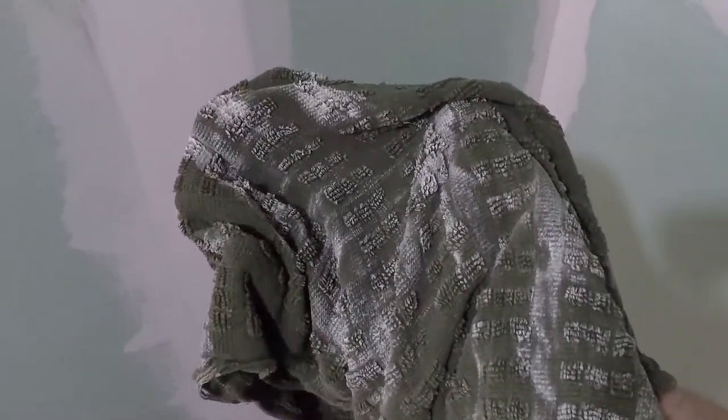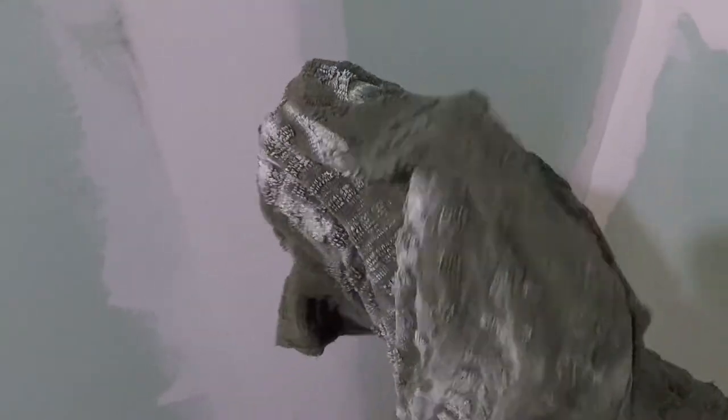The next step I'm going to do before I start spraying is I got a damp rag — I'm just going to wipe down the walls and get all that loose fine powder off. That way the mud sticks a little better when you spray it on the wall. It's kind of like flour — it keeps your dough from sticking on the counter. We don't want that; we want that mud to stick as good as possible, so we're just going to wipe down the walls real good.